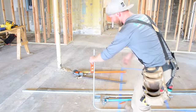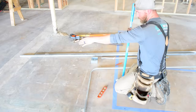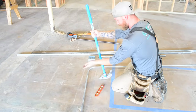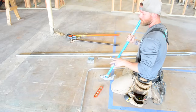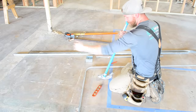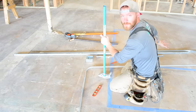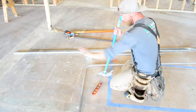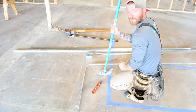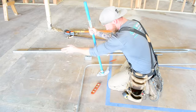And the reason you call it a forward 90 is because the end of our pipe that we brought our tape measure from is the front of the pipe. So we did a takeoff of 5 inches and bent that side of the pipe towards us. Anytime you're gonna do a 5-inch takeoff or 6-inch or an 8-inch takeoff, you're always gonna put your tape measure at the end, bring that takeoff away from you and bend that side up. The whole back side of the pipe you're not even looking at. So everything that you're dealing with is forward, out in front of you. So just remember, when you mark 36, don't take back 5 inches towards you, take forwards 5 inches, and then point the bender towards the front of the pipe and bend that side up.